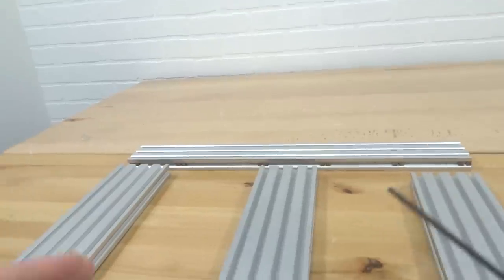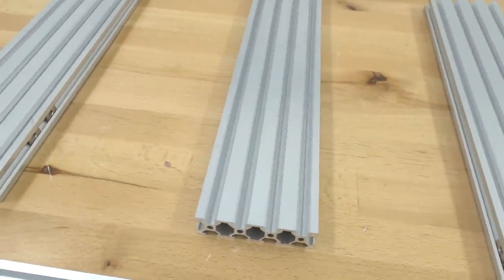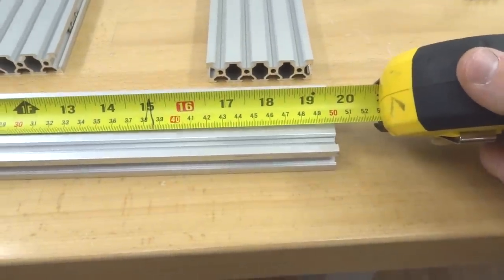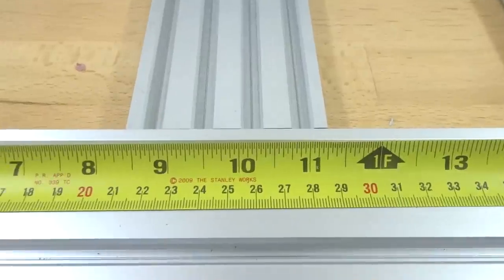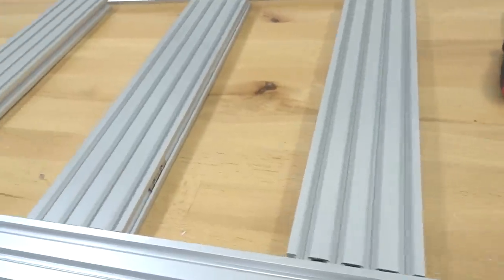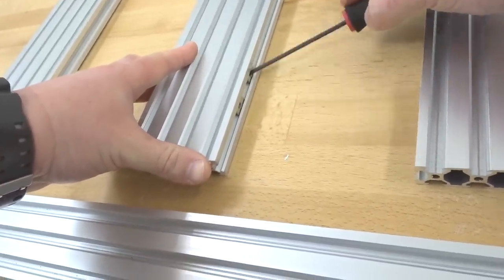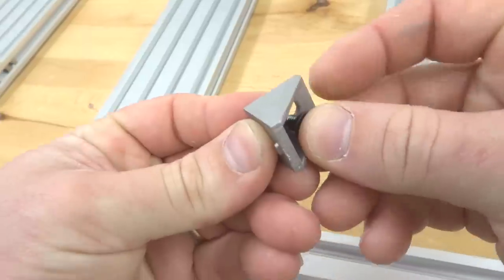So we have our 20 by 60 rail here in place. Let's go ahead and do the same thing to our opposite rail, manipulating these T-nuts into place. Before we start mounting, we're going to take a measurement to see exactly where to place our center beam to make sure our system is square. The 20 by 60 rail is at 500 millimeters, so we're going to take half of that — 250 — as the placement of our 20 by 80 rail in the center. Simply align your 250 to the center of this rail in the middle of the 20 by 80. Now we're going to mount our corner connectors to our 20 by 80 rails. We have two on each side of our center beam — push one to each end, take our cast corner connector and an 8 millimeter screw, and go ahead and lock that into place.